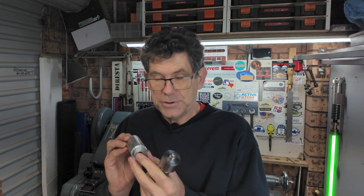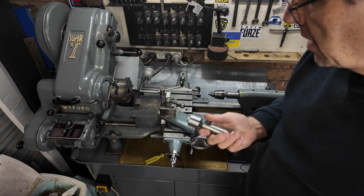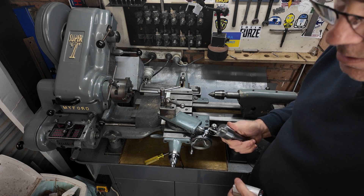I've made these washers that fit exactly in the end and I'll press those in. Then I can hold this end in the three-jaw chuck and squash down and it will be supported by that ring. On the other end I'll jam in the washer and use a hose clip to go on the end and tighten that up. That will just stop it from vibrating or expanding or moving — it will give us more rigidity. At the end I'll be able to knock out what's left of these washers and we should have an expanding mandrel.